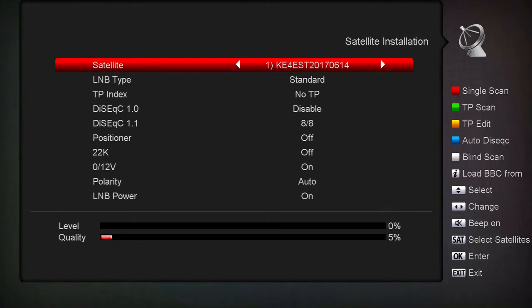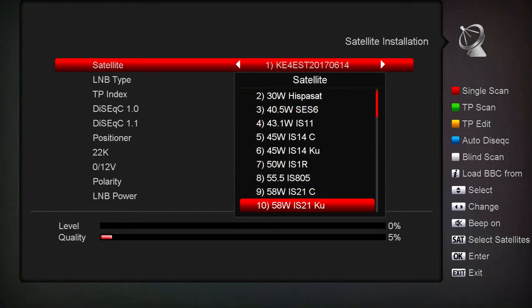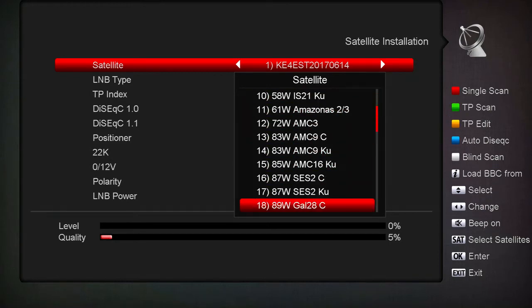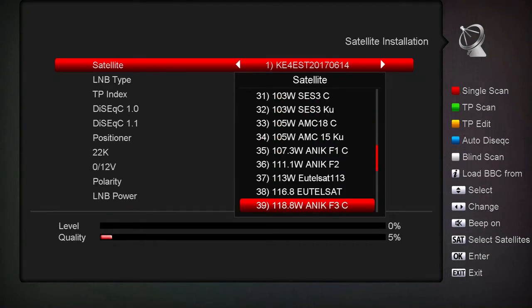Now some receivers you'll get sent and they'll have a few transponders in it, and this, that, and the other. So far everybody's been liking the way I do this. It's kind of clean. When you get this box, there's no transponders programmed in. The main reason I did that was because over the years a couple of people complained. They would say, hey, I've been trying. You said to go and put in an active transponder and try to tune in my dish, but it still ain't working. Then after a few emails or a call, I'd find out their active, quote unquote, transponder is a transponder that's already in there, and they assumed that it's active.